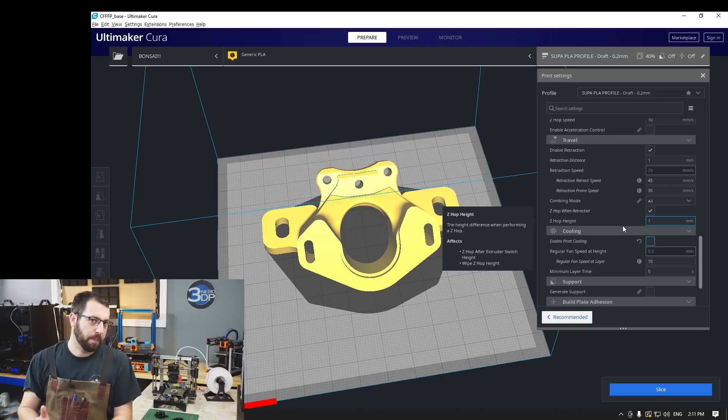It is possible to run cooling fans with ABS. For example, on my enclosed Voron V2s, I do run a part fan anywhere from 10 to 20%. However, they are fully enclosed with ambient air temperatures near the bed around 50 degrees Celsius for most things I print. A very minimal fan, fully enclosed with high ambient temps, can help a lot with overhangs and bridges, especially for print quality on finer details with ABS. However, if you've never printed ABS before and you're unsure how your printer is going to behave, I recommend starting with no part fan enabled.